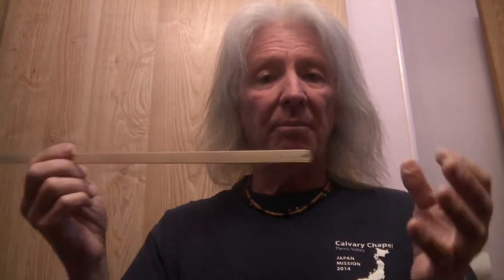As far as the tools: I have a set of 12-inch channel locks, and just a piece of dowel — it doesn't matter the length. If you've got a scrap piece of wood laying around, as long as it's a small diameter, I wouldn't go more than a half inch — something you can stick down into the pipe of the sink. Paper towels. There will be water in here, so have a little bowl set underneath to trap any water that leaks out.